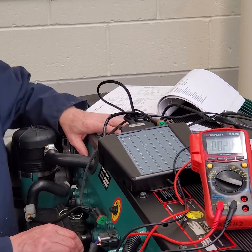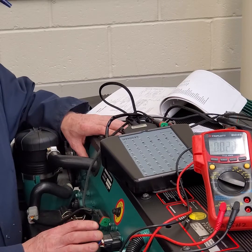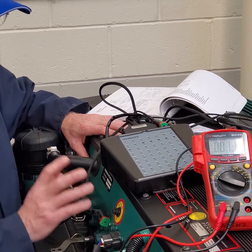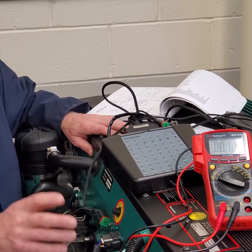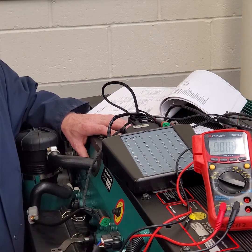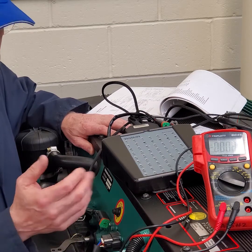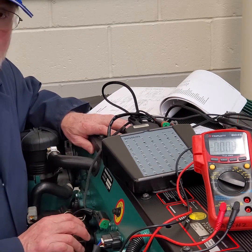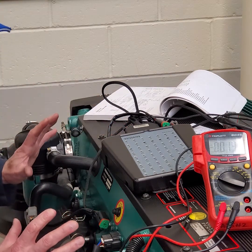In this video I want to go over the communication between the Vodia tool and the diagnostic link to the engine. For example, if you have a problem with the engine — doesn't run right, won't start — and you plug in your Vodia tool and you don't have any communication. If you tried your Vodia tool on another known-good engine and it communicates just fine, and being an older engine it probably doesn't need an update, let's go through that diagnostic routine.